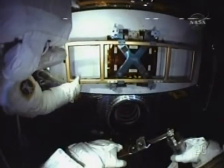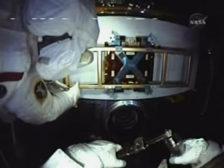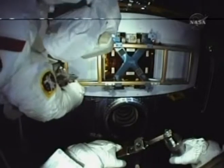No turning. Yes, the MTL is slipping. Copy, John. I see our next is to remove the MTL and try it without an MTL at all. Houston, Atlantis, if you heard my last, you concur with that step 2? Mass, we're talking, hang on. Mass, I put in 3 attempts. Probably got about 3 MTL slips on each attempt and see no motion on the A-latch bolt. Copy. Go ahead and put it in there if you would.